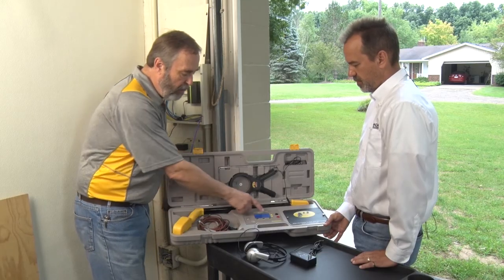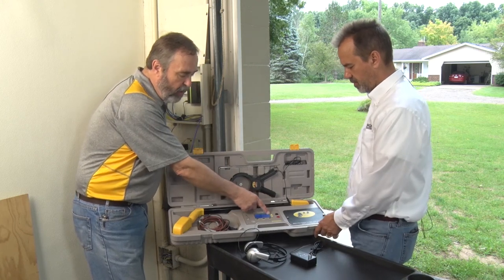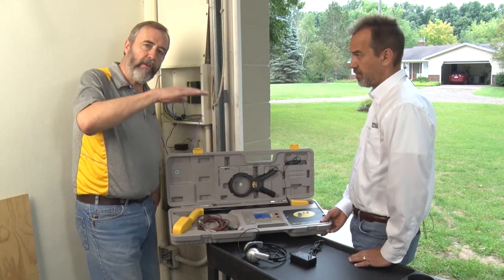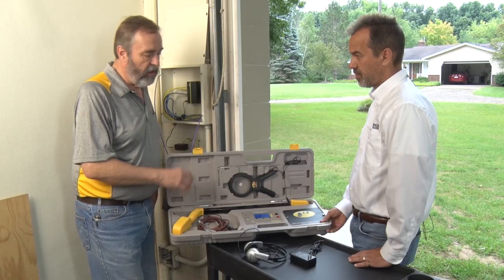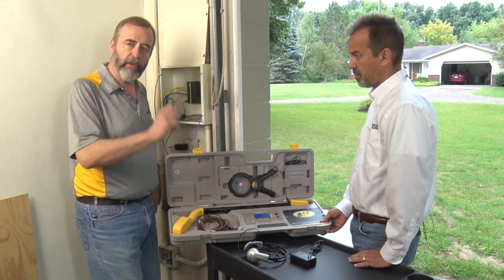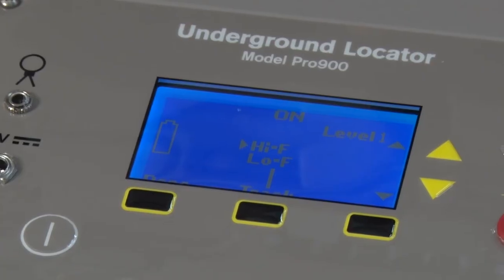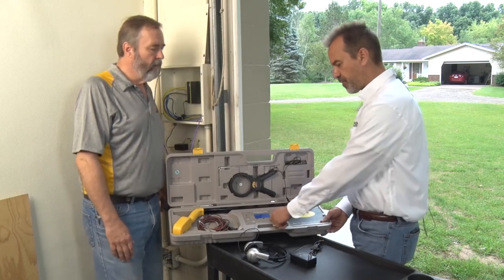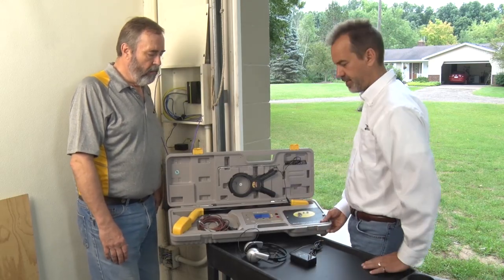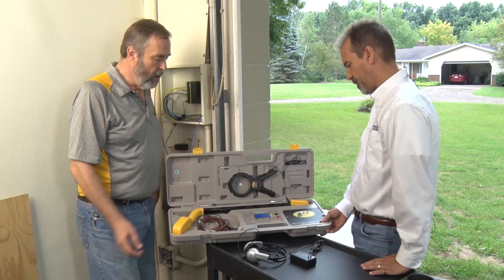It has up to eight power signal levels. Start with a low power level to begin with and you'll probably be happier. There's also a battery meter — a gas gauge — in here. When you have a good signal going out, you start to see the meter increase. If you've got a good quality indicator during a clip-on location, the bar kicks up and you get a little indicator showing you've got a good locate happening. It says 'OK,' meaning you've probably got enough signal in the wire to get a good locate. This is replacing the old five or six position switch and the analog meter.